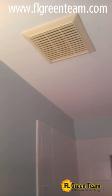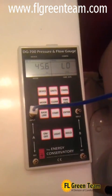One final thing that I'm going to test is the actual exhaust fans that exhaust the air from the bathrooms to the outside. You might also have some in the kitchen. But depending on how much you pay for them and how old they are, the dampers on these are also very loose. Nowadays they also have some exhaust fans that have a humidity sensor in them. So I'm going to put the pressure pan right on there, and we're going to take a look at the reading on the manometer. We have a 45.5.